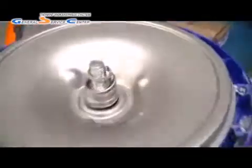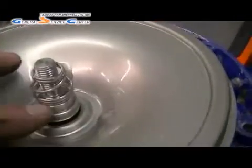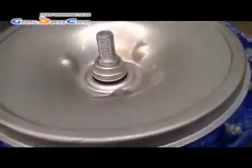Okay, that's the impeller off — this is the impeller here. It sits on top of there like that, screws on and off. That's your shaft seal — this is part of your shaft seal, it's just a spring for the impeller. This is the shaft seal here. So we'll take that off and we're nearly there — we'll get the motor out and have a look at these bearings.